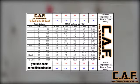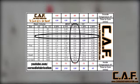So on the left, say you're mixing up a batch of 8 ounces of resin. And I've found that generally a 1% ratio is the best, as if you put in too much MEKP, you risk shrinking at far too rapid of a rate. So again, if we had 8 ounces and we wanted 1% MEKP by volume, we would put in 2.4 milliliters.